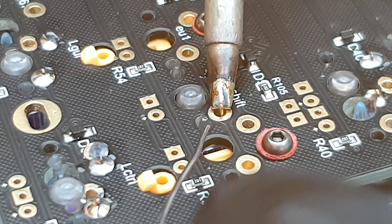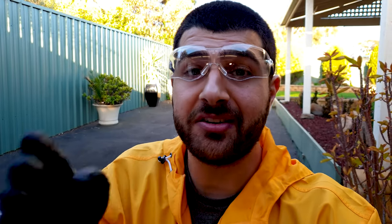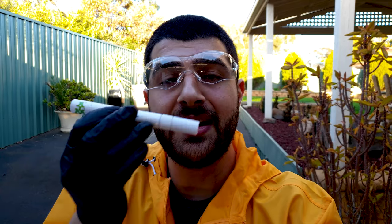Make sure you place your soldering iron on the pin and the pad at the same time — it needs heat to suck up the solder, otherwise it'll look bad and go bulgy and round, or it won't solder at all. If it still doesn't work, you can use something called flux or a flux pen, which helps suck up the solder much better. Just dab it onto the soldering joint. If you need any help, join my Discord down below and I'll be happy to help.